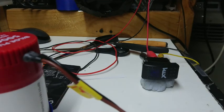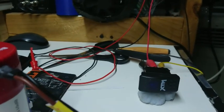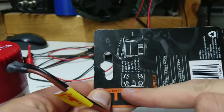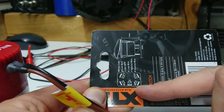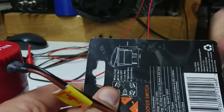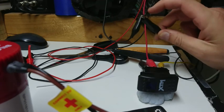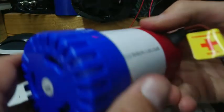Let's have a quick look at the setup. My little distribution board is supplying 12 volts to the switch. Negative goes to pin 8, positive to pin 2, and positive out to the pump on pin 3 - that's literally it. For a non-illuminated switch I would just switch the positive. The negative is also bridged directly to the pump in this little junction - negative in, negative to switch, negative to pump. And now we have a working bilge pump, which has got a bit of grunt to it.